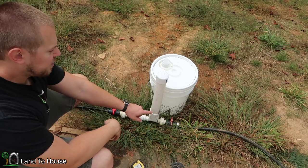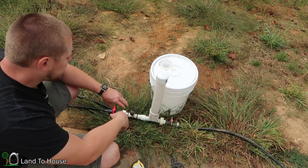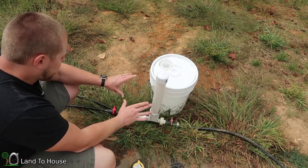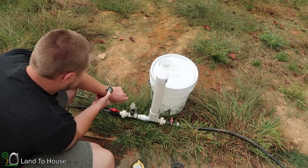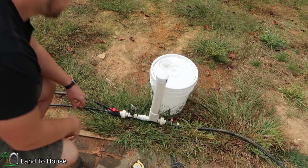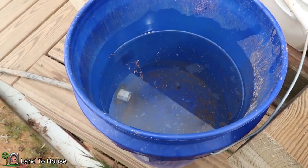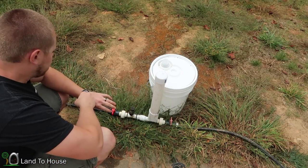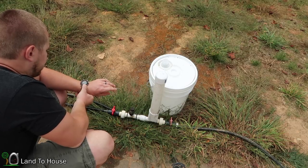For test one, I have the delivery pipe closed and I'm going to time how long it takes for this style of pump to drain that five gallon bucket. I've already got everything primed — it should start on its own when I open this valve. At 3:40 I heard it pull its first air, so we'll consider it to be three minutes and 40 seconds.